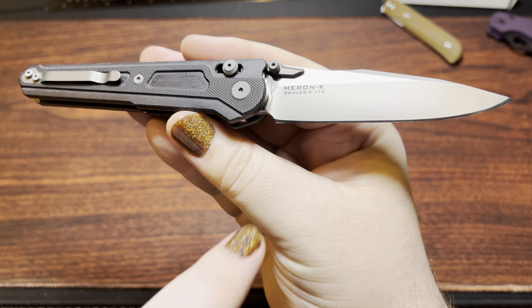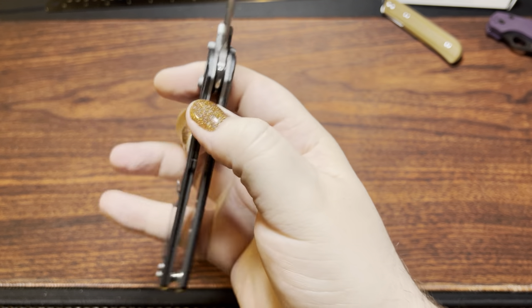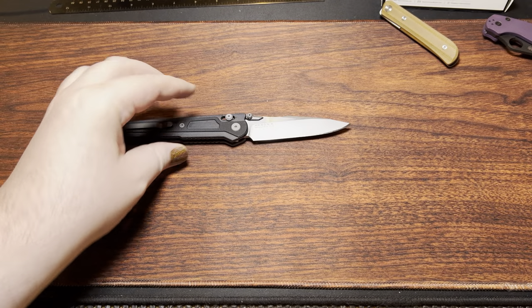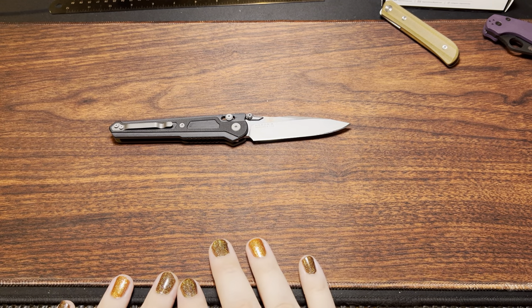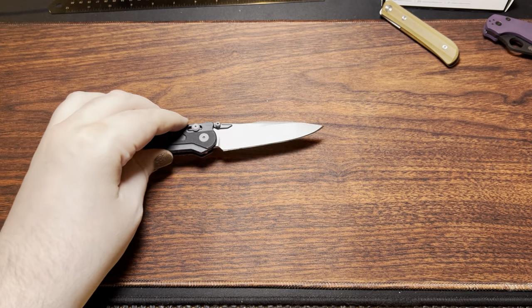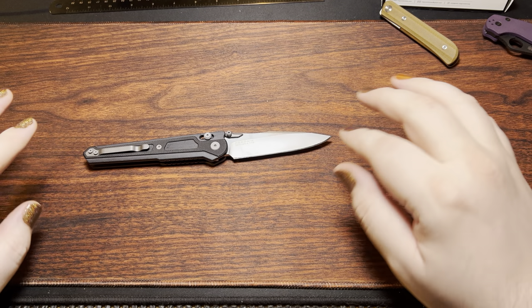I just got this off the sharpener but it looks like I still have a bit of a rolled edge at the very back end to deal with. This one is in Böhler K110 — if you're not familiar with that, it's exactly D2, just made by Böhler rather than the generic formula. A lot of manufacturers are now using it since they also deal with Böhler. And guess where M390 comes from? So they pick it up because it looks different and doesn't say D2, which a lot of people are getting fatigued with.